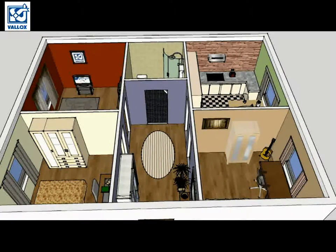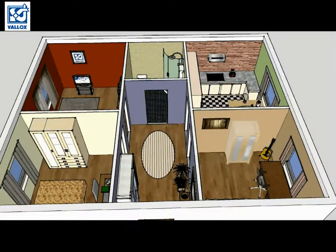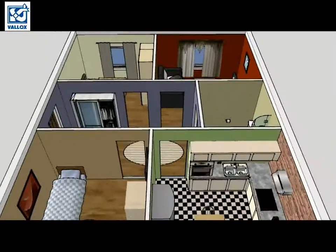That is truly bad news for people who are living in this apartment. For air to stay fresh, it should be replaced with outdoor air once in a two-hour time. And without ventilation, it can be that air is just not changed at all. Also, moisture needs to be taken out from the apartment, so we would really appreciate good ventilation.